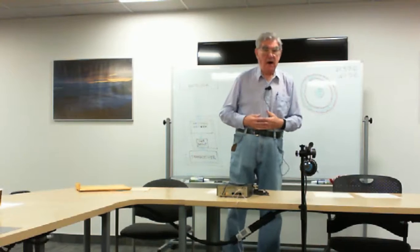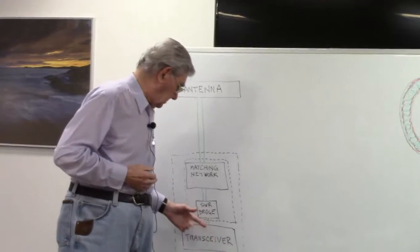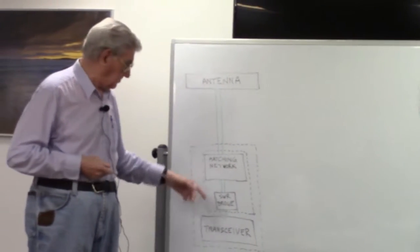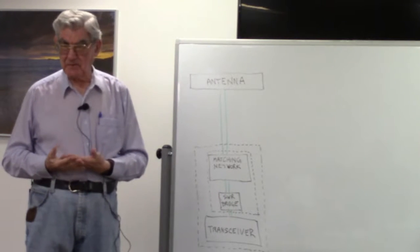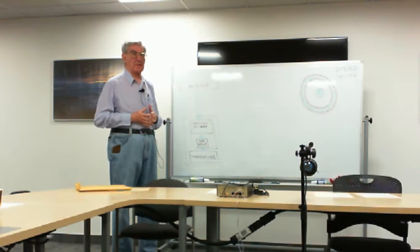So you need to be aware that there is a delay in the speed at which the energy travels. In typical coaxial cable, it's 66%. With open wire line and ladder line, it's, if I remember correctly, about 95%. Much, much faster.